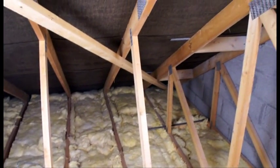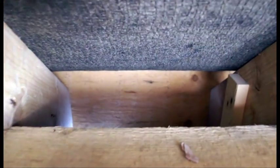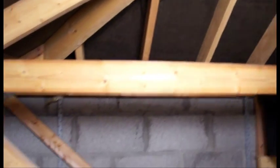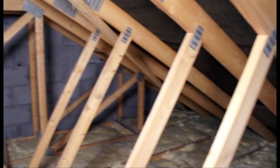This looks familiar — there's about 4 inches of fiberglass on the floor of this attic and a standard cold roof construction detail. That means that freezing damp cold air can breeze through this attic space with ease. I can even see daylight out through the soffit. In the freezing winter just gone, water pipes above the ceiling insulation burst and caused thousands of euros worth of damage to this home.